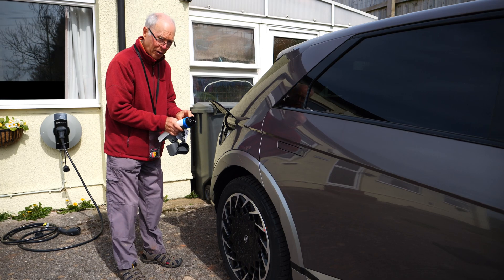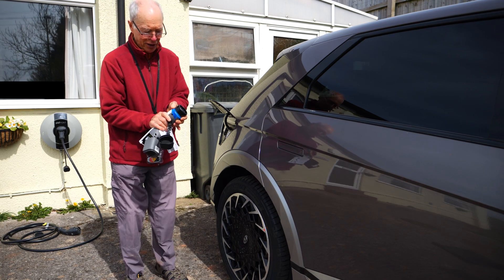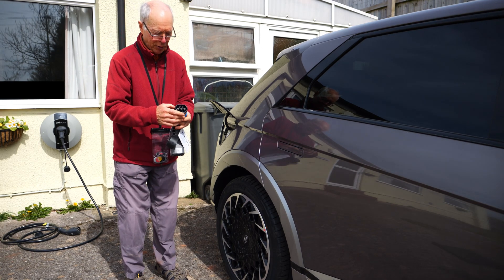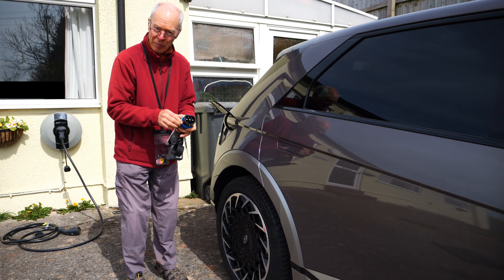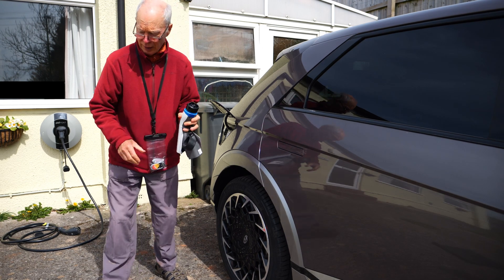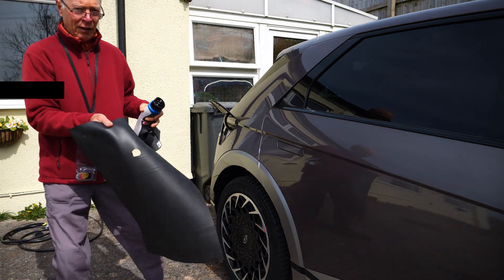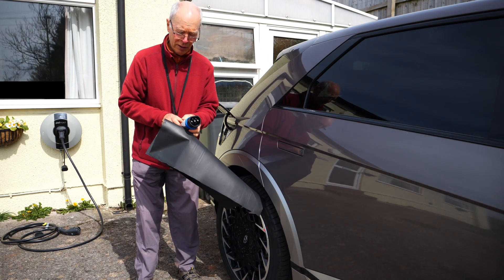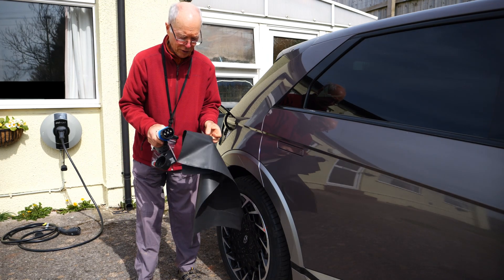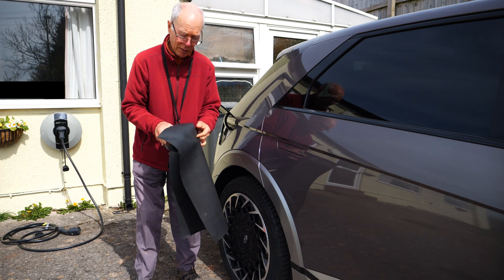What I've put round here is some electrical tape to seal the gap between this plug and the casing. But that by itself isn't enough. I've got this EPDM — this is a rubber sheeting used for roofing, not PVC. It wants to be rubber, and it's quite elastic.